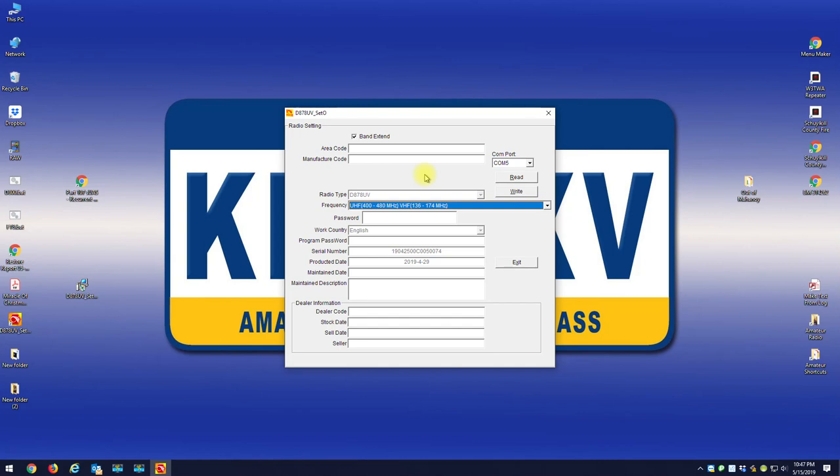This is the band plan that used to come with the 868 and the 878, so there's a 99.9% chance you guys already have an existing code plug for this band plan. All you want to do now is just click 'Write' to write the radio. It's going to change your band plan to the normal band plan that used to come with the AnyTone radios, and it's also going to unlock the feature where you can hold the PTT button and the number one button to change bands.